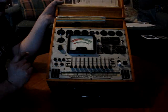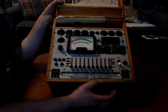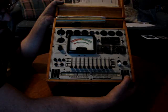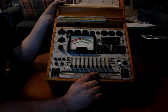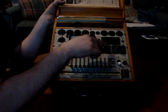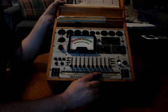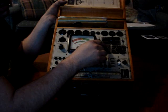You fit the tube in wherever it goes, and you turn this chart and find the tube. There's the 12AX7 right there. The chart tells you how to set all the switches. This is A, so you find A in the chart — for A on the 12AX7, you set it to 1. Then B is 7, so we set B to 7. That's the filament voltage.